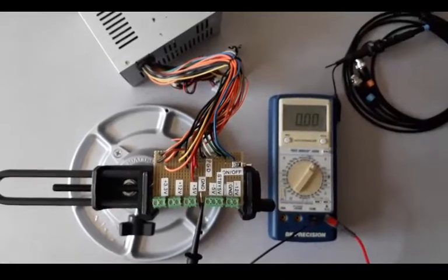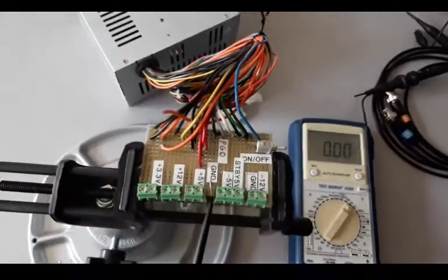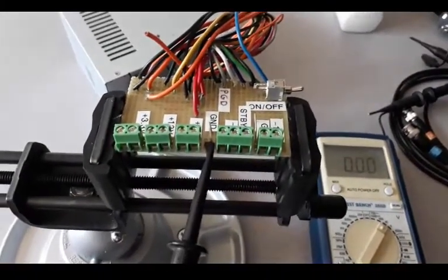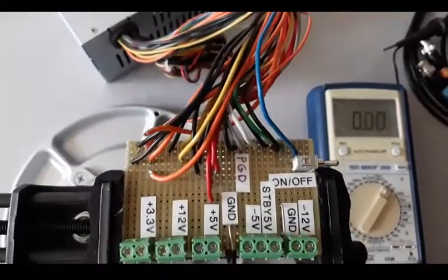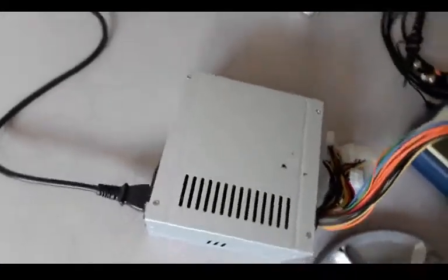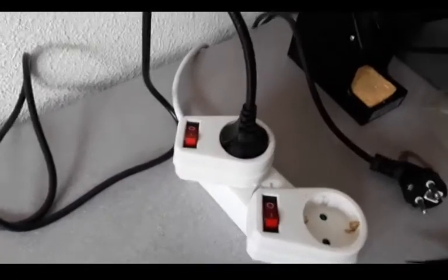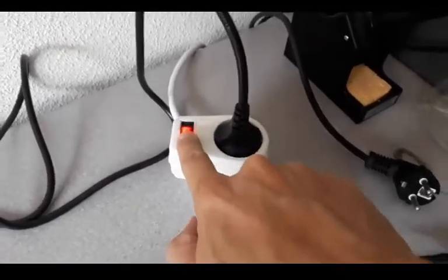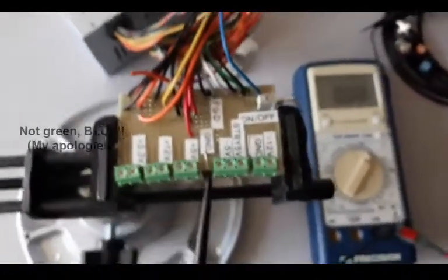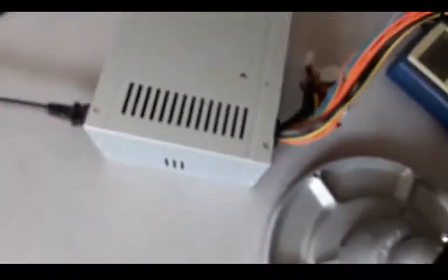Here's the other silver box power supply after I cut off the main connector and converted it into a breakout PCB. You can see I've got spring-loaded clamps that allow me to connect different wires, and I've soldered a lot of the wires in parallel to give me more power. This particular ATX power supply doesn't have a switch on the back, so when I want to turn it on, I'm going to use one of my little independent switches. When I do, we don't hear anything and the fan is not running — that's because it actually has an on-off control on the green wire. So I'll come over here and switch it on, and now it makes lots of noise.